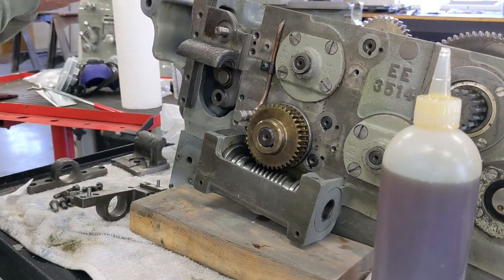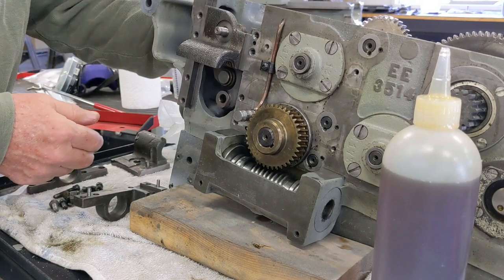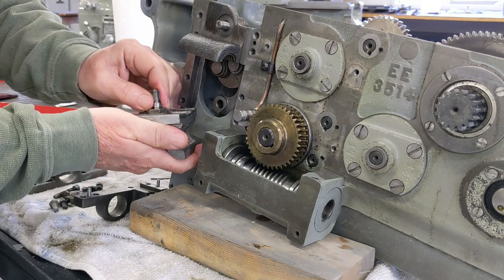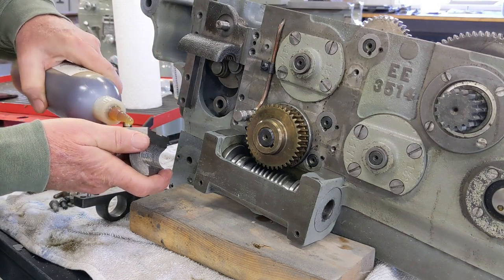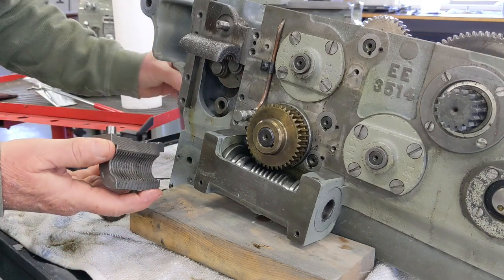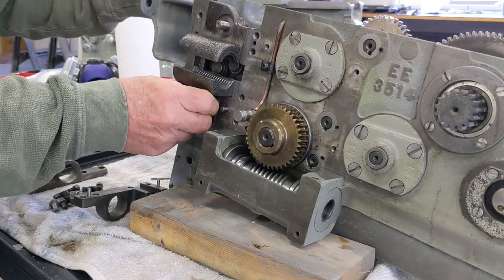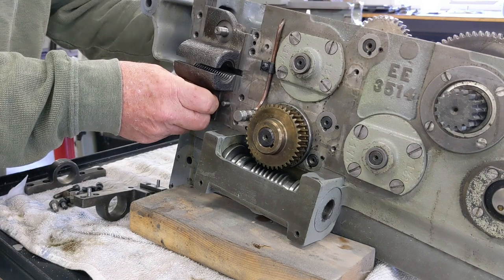I'm going to take a little Allen wrench and put it through the tapered pin hole in the actuator here and just make sure that it's moving. Now we'll do the same with this side — get a little bit of way oil in here, stick it through there like that. We'll put some oil in here and get these folks in there. Everybody's in there and we'll just give this a try to make sure it's going to operate. Okay, nice and smooth.